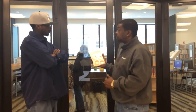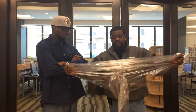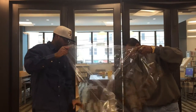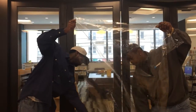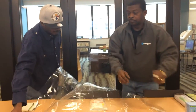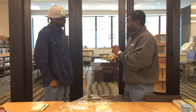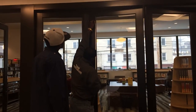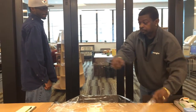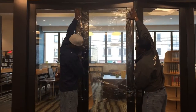These are window plastics for eight windows and I'm going to show you how to put one up. First thing you want to do, son, is open a package. Now, you will find that this plastic, which looks so small, actually spreads out large enough for a window. Grab one end and grab the other end here and we will stretch it out. You could do this by yourself, but it's really a two-man job. Now lay that down — what we have here is the double-sided adhesive, and what we'll do is place that here along the seam of the window. Once that's in place, grab your end and place the plastic right over the top, on top of the double-stick seam.